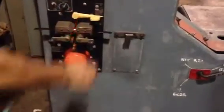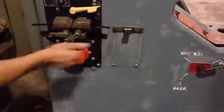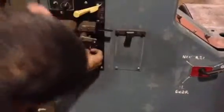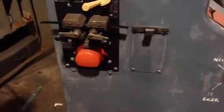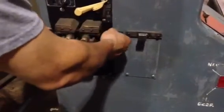You can see here you have your variable speed controls, a DBW-15 blade welder grinder and shear. Here he just welded, now he's going to anneal — he's annealing. We'll take it out and show that it took. You can see there, I made a weld.